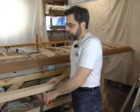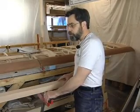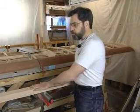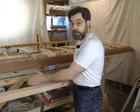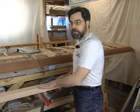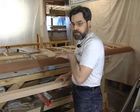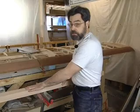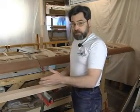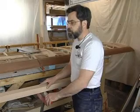Today I'm going to use this piece of spruce as an example of an aircraft spar — this is a cutoff piece from a Curtis Jenny project. We would have cut this on the bandsaw, so we'd have bandsaw marks on all four sides that we want to remove. Every piece of wood has a grain that runs a certain way, so as the wood passes through the planer, you're going to want to notice if the grain is lifted or not. You'll mark it with your pencil and only pass the piece through in that direction, otherwise you'll tear out the grain. The machine is very loud, so wear your hearing protection.